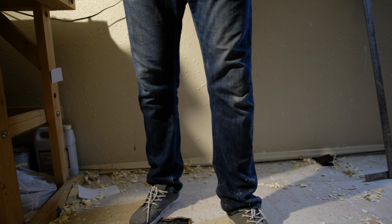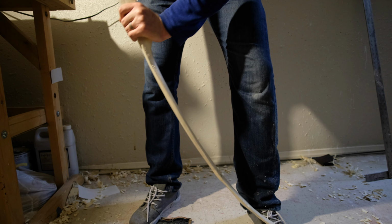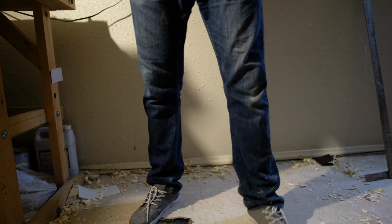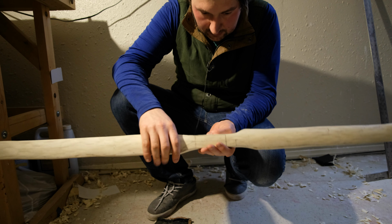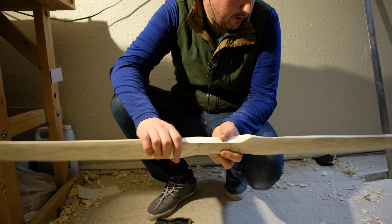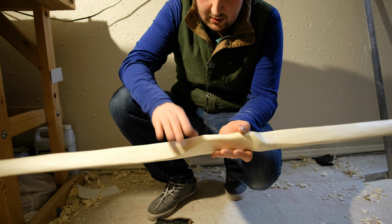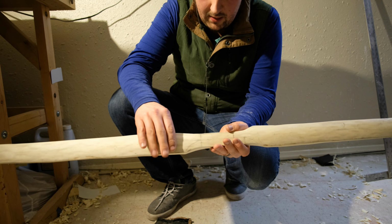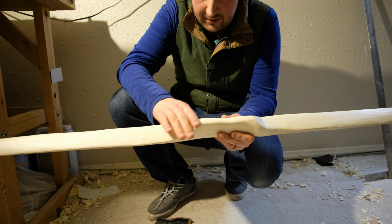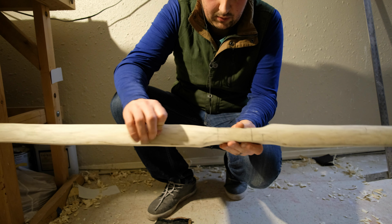That's the bottom limb. Here's my top limb. So, yeah. Got the basic shape of my bow out, down to a floor tiller. Now I'm going to wait 60 more days, let this thing dry out a little more, and then we'll move on to tillering. And I'm going to toast the belly of this thing, and we'll see about finishing.